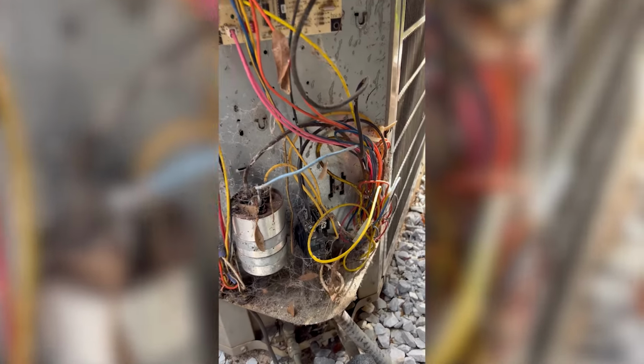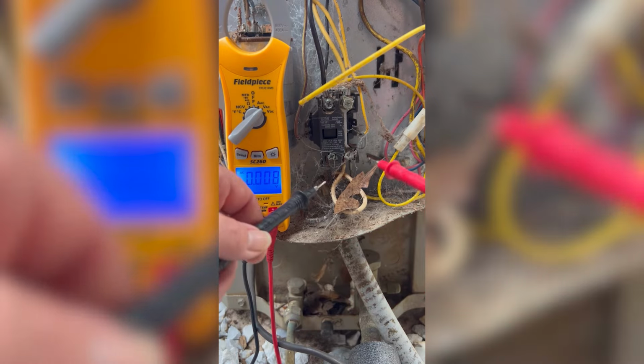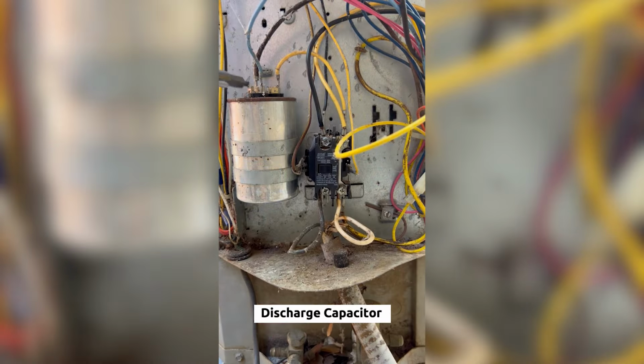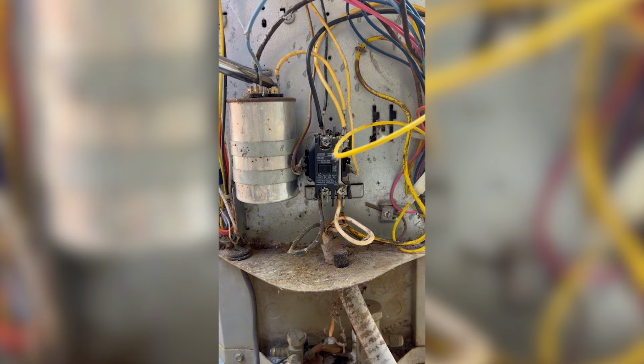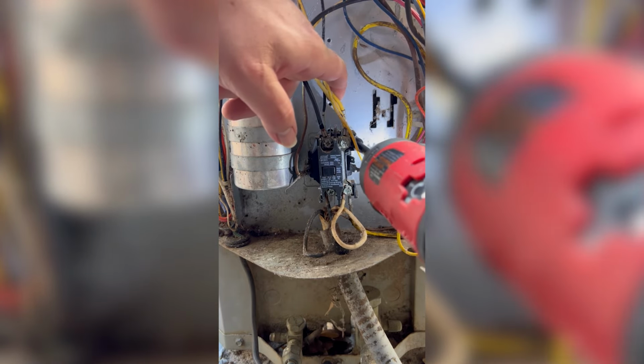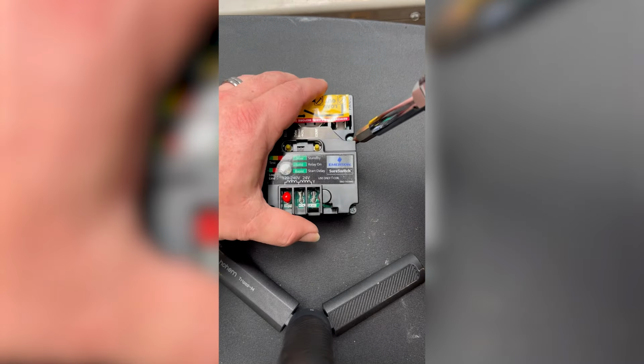Now we can identify the contactor and look for obvious signs of failure, such as burned or broken wire, as well as ensuring that no voltage is present. I'm going to be wiring this wire for wire, but it's still a good idea to make a note of the current wiring configuration. The SureSwitch is completely sealed.